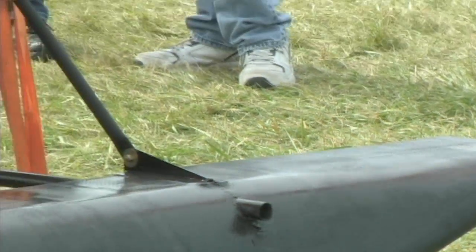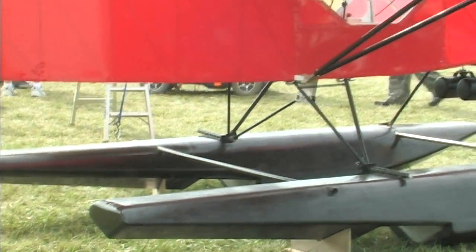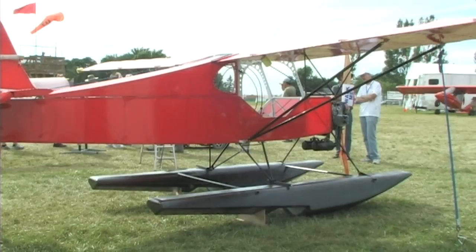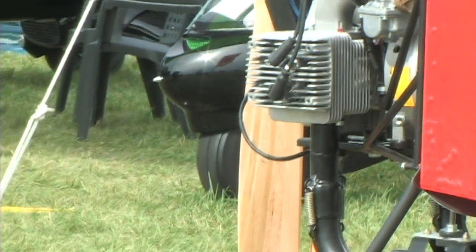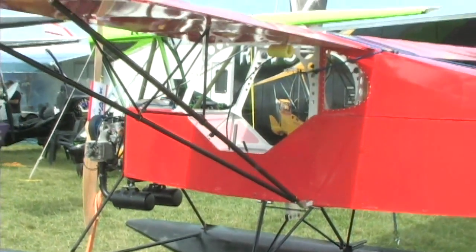Is that sort of what we got here, except in a more durable form? Far more durable. You have this foam structure that's been wet laid up with the carbon fiber. It uses single, double, or more layers of carbon fiber in the critical spots. It ends up being a lot stronger. I mean, off the shelf, it is just amazingly strong. And the weight. Because we used a hollow foam construction, we ended up with a weight of about 20 pounds a float.